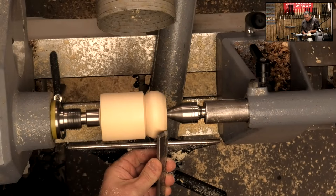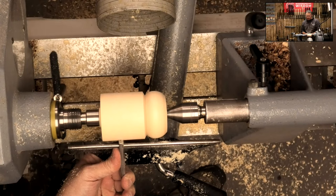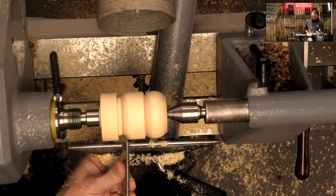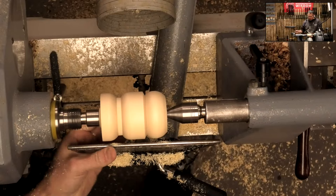There we are, down to the peak. And one more cut. And a couple of rolls. This is the peak. This is the belt loop. So perfect. Little quarter inch, 6 mil beading and parting tool that was. So this is now the waist we're bringing in. Down to that little belt loop, tidy at that bottom.